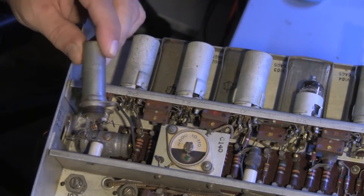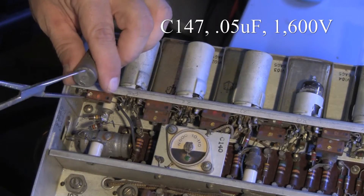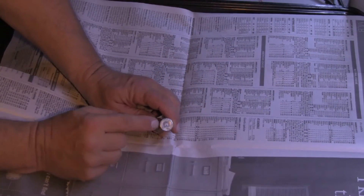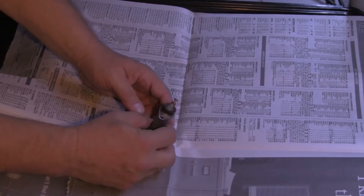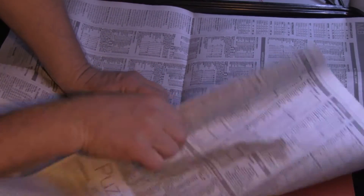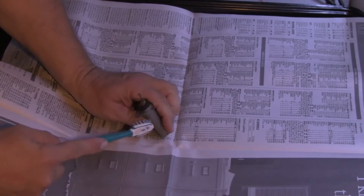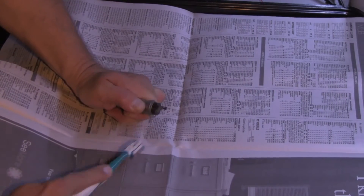And this is what we will be rebuilding. I have to take the solder out of that end. Before I can melt the solder out of this end, I have to drill a hole in this capacitor because it has oil inside, and I don't want it to pop in my face. So once again, we'll clean it up a little. No need to vaporize all that dirt into the air.